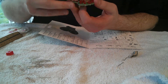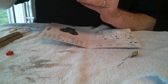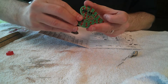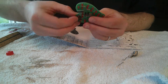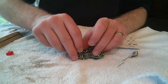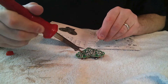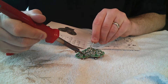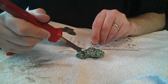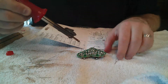Same thing — find the plus and minus sign on the board, find the plus and minus sign on the component, line them up like so, and just bend the component over. You really can't screw this up; there's a diagram on the board showing where the component is supposed to sit. And solder away — there's one lead, there's the other lead. And very good.